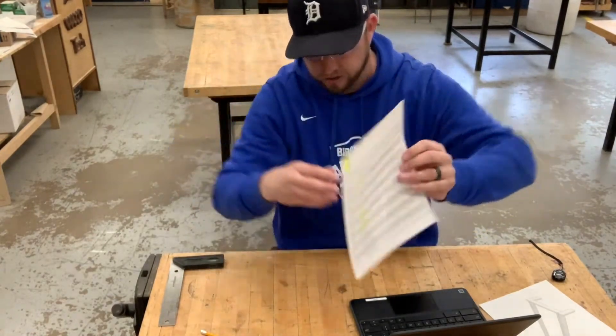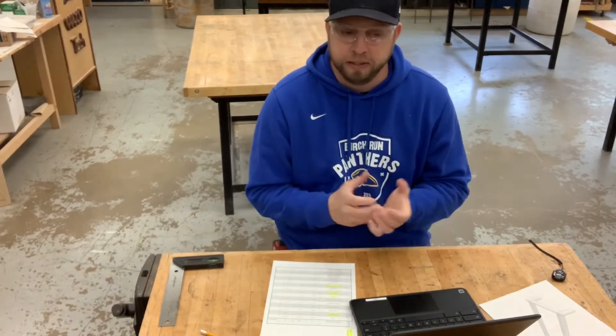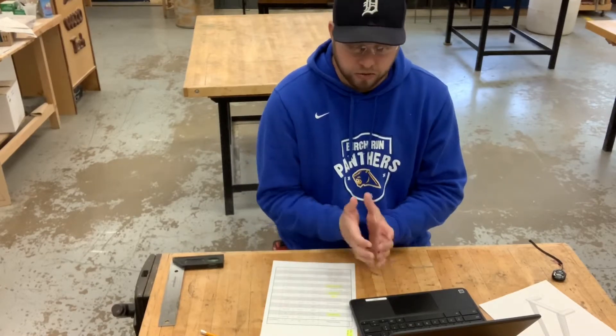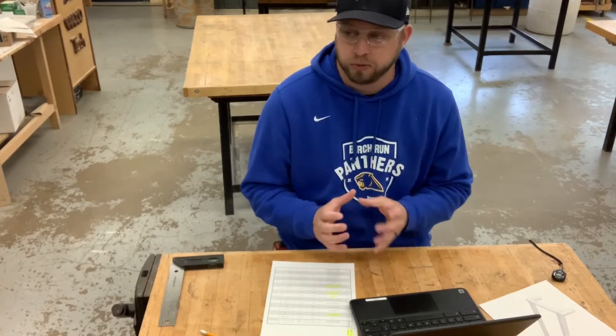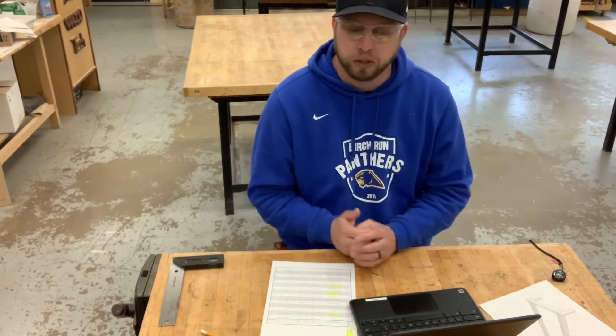The stuff in yellow is the parts we need today, and I'm going to be building two of these. We have a new house — it's got a pool, nice backyard — hopefully the weather warms up pretty soon. So we're going to build two of these for the pool deck. Now the first thing I want to say is that when we did the material estimations, we figured out together that you need seven 12-foot two-by-fours and one 8-foot two-by-four. Because I bought a ton of material for your projects that we never started, I've got a wood room full of material I'm going to repurpose to make these chairs. So I'm going to be using 8-foot two-by-fours, which is not the most efficient way, but the total was only within three or four dollars of using 12-footers. So it's not the end of the world — we're going to use 8-footers.